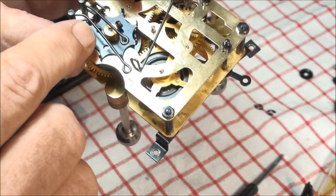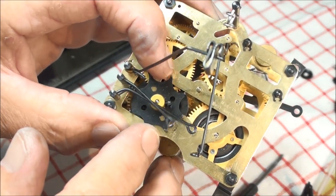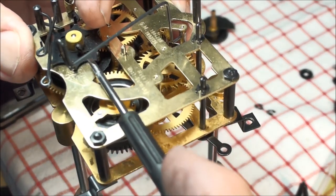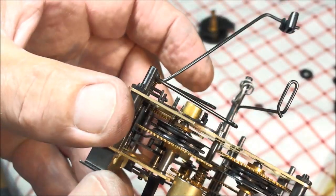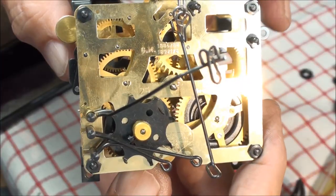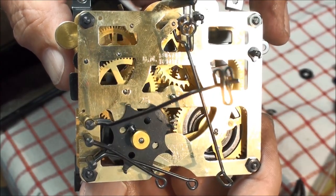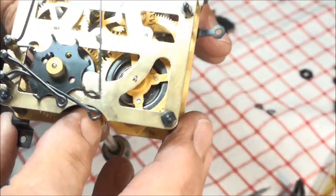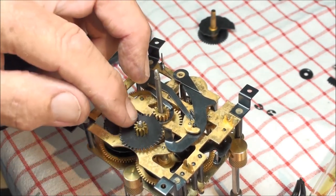Cuckoo. Let's spin around so we can get this a little closer, easier to get to that screw. So what you're looking for is a gong. Cuckoo. When that coo goes down, that's where you want it. Snug it up. You don't want it pressing against this plate. There is a little bit of a gap there. Not much, but there is one there. And so now what we'll do is trigger this. So when that last leg falls down, that's what you're really looking for. So I think that's set for our timing there. Now we can just throw this stuff on here, we'll say. You can oil that.